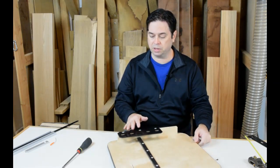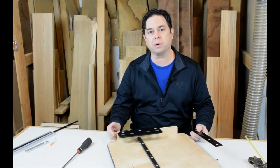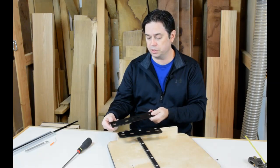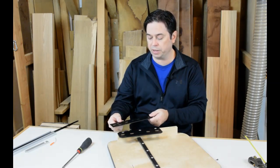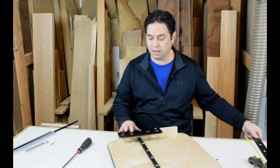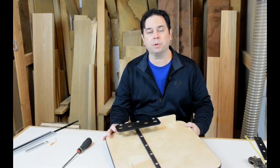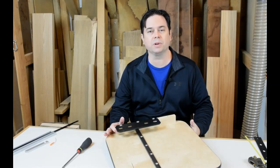It wouldn't have to look exactly like this. I think a quarter inch aluminum bar stock would work fine. Something like this that was about 2 inches wide and maybe 3/16 inch plate steel would work just fine. I found these at a farm type hardware store, and they happen to be cut to length and pre-painted already, very inexpensive, so I just went with those.